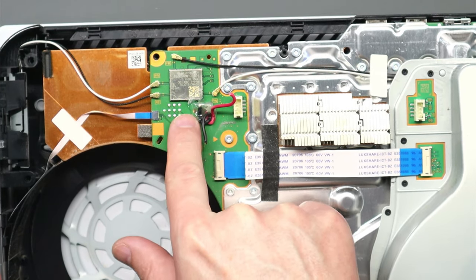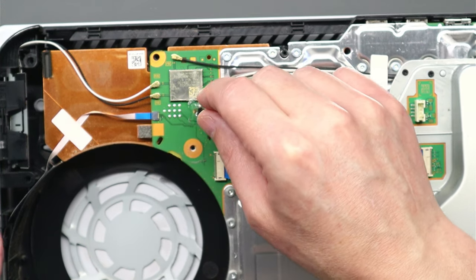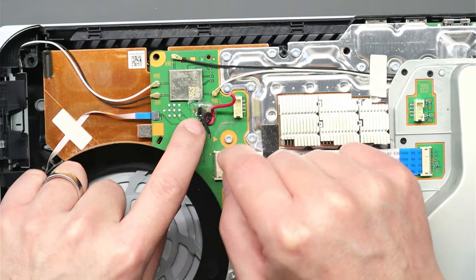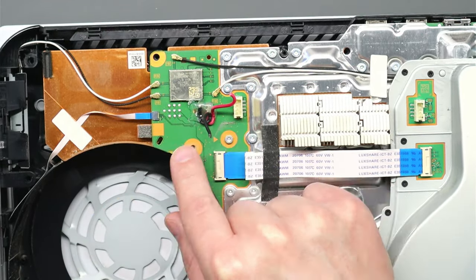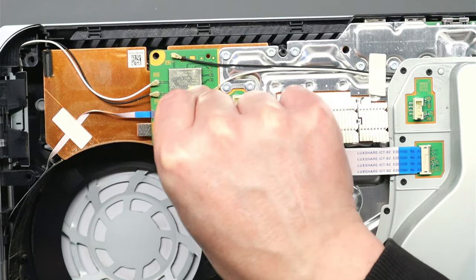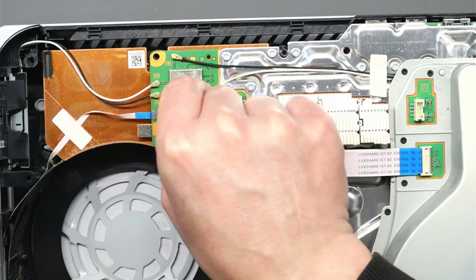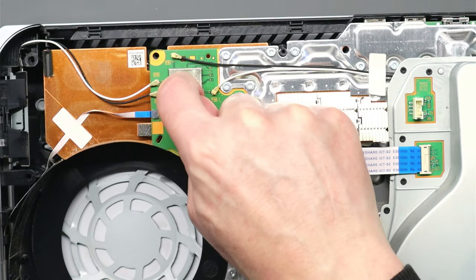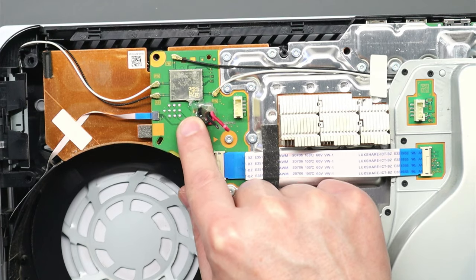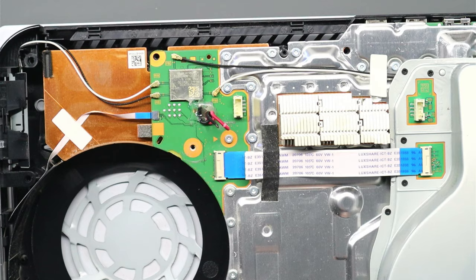Now, it's relatively common that this actual fan connector breaks off, because some people, when they detach the fan, literally just yank up the cable without actually supporting the connector, which looks like one of these. So what we're going to do is clear up this area. There's some hot glue over the soldering job, so first of all, we need to remove all of that. I hope that hasn't done any damage to the Wi-Fi IC. We'll remove all of that so we can get a proper look and clean up the motherboard and all the connectors on there, and then we can get that connector replaced with a proper connector.